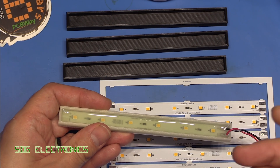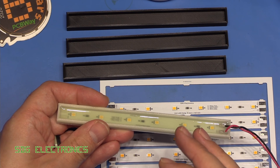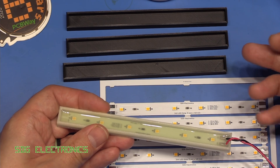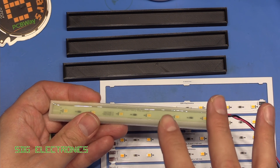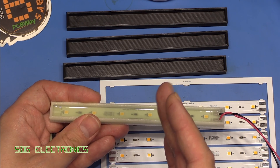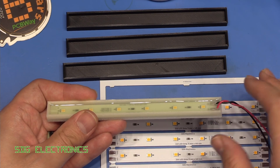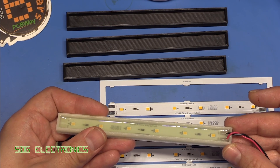I don't have the ability to work out the colour temperature, but what we can do is use the spectrometer and have a look at what the colour spectrum actually looks like. We'll have one control to see what the light from one of these LEDs looks like, and then do a test with two different types of resin to see if the peaks have changed. We'll probably see a blue peak, and then somewhere around the yellowy-green region another peak. Perhaps we'll see a shift of that peak to make the colour temperature of these warm white LEDs appear a little bit colder.